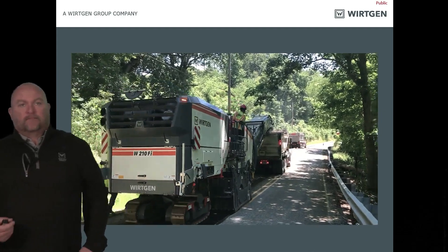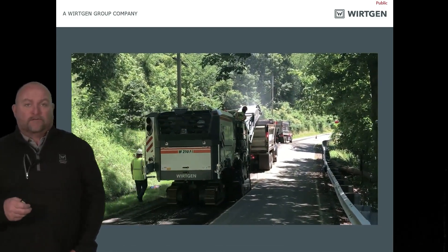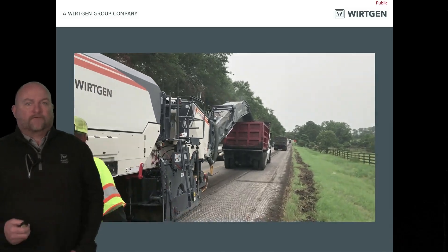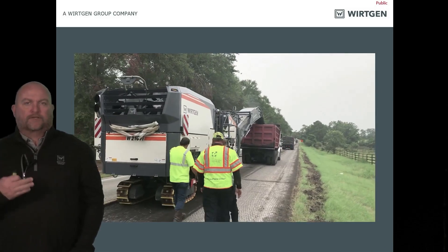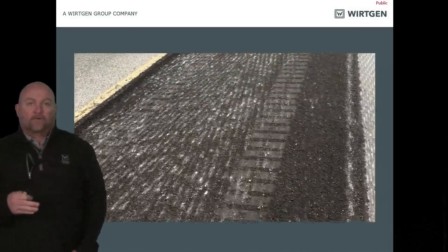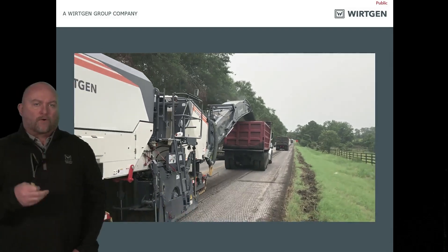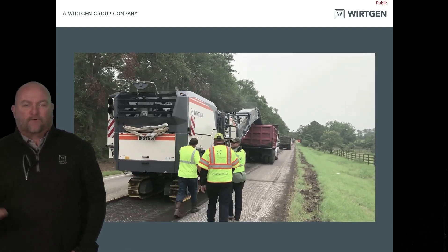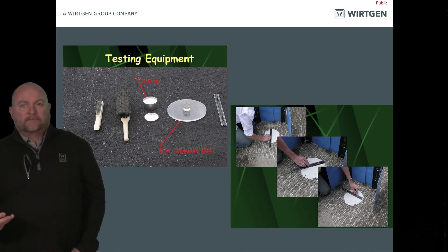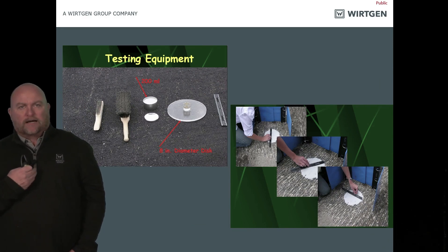Here's what not to do: there's 240 feet per minute. The bad thing about this video — around that corner, they hit a buried manhole cover. Not a good day. There's 303 feet per minute. And remember, milling — we're production-oriented people. You give us 1,000 horsepower, we're going to bring it to its knees. But this is hurting us greatly when it comes to the quality we're leaving behind the machine. Yes, it is fun to watch a milling machine go fast — until somebody breaks out the sand patch test at your job site to check for smoothness of the pattern. They've really started putting more emphasis on the milling side, as they should, because for decades we were the ones that came in, made a mess, and left it for the paving crew to clean up.